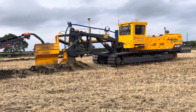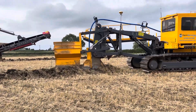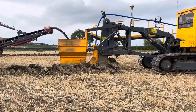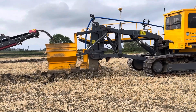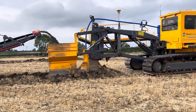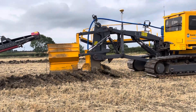It's an interesting machine this — it's got a plough share on it as opposed to a kind of trenching machine. So we're putting 2 inch, 50mm perforated blue pipe in and then gravel backfill to enable us to mole into that loose gravel. Mole drainage is a tractor-driven machine that puts a tube into the ground that goes into that gravel layer and allows the water to circulate through the gravel and then into the drain.